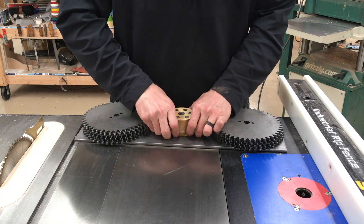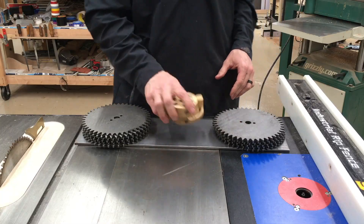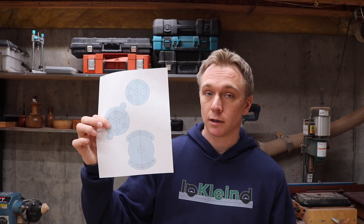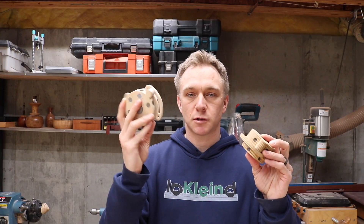It's done - I didn't show putting the screws in to hold it all together, but that's pretty simple. You've got yourself a magnetic switch. If you go to the link in the description you can get templates for the large and small magnets for five dollars, plus the best source I've found for the magnets themselves. The small switch magnets cost about ten dollars to build and the large about thirteen, plus a bit more for steel rods and plywood. For comparison, this is roughly equivalent to the Mag Switch 150 and the Mag Switch 95, which cost about thirty-seven and twenty dollars respectively.